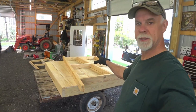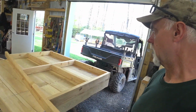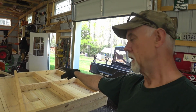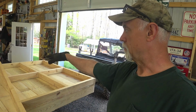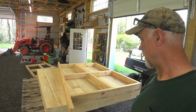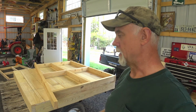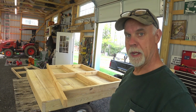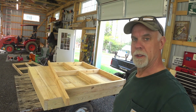Okay, I've got the 2 side walls done. There's one over there, and this one, 4.5 feet in the front and 3.5 feet in the back. Now I'm going to go get the 1x6s off the pile, board up both sides, stand them up, build a back wall, and then do something about fashioning the roof on here as well. Temporarily, of course. I need to be able to take this in pieces out to the pig pen and erect it out there. So I'm going to go get the 1x6s and start putting them on the side walls here.